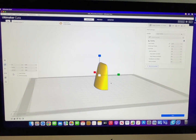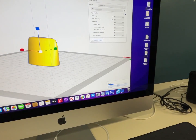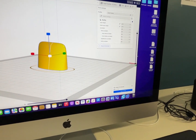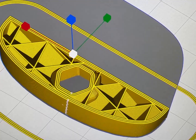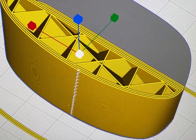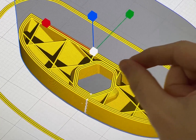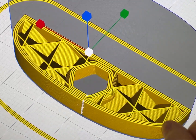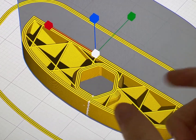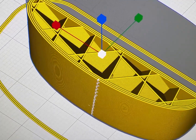There's one last thing you must do if you want it printable. We load it into the slicer software and go to slice. What I've had to do is make it a cone, because if you have it just flat, the 3D printer can't print over flat — it's like Wile E. Coyote trying to build a bridge and it just falls over. You make it a cone so it can slowly print smaller and also give room for longer tripod bolts.